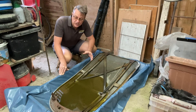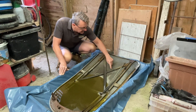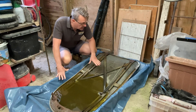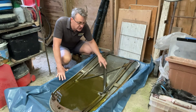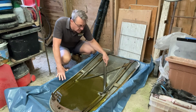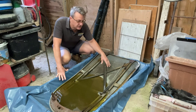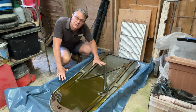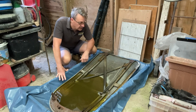So I'm going to buy a couple more bottles of the crystals, replace the plastic, fill it up, and complete the rest of the job. Importantly, the aluminium is fine - it's not affected that at all. So I haven't got any worry about it corroding or damaging the aluminium, which was the whole objective - to get rid of the rust on the steel but have no impact on the aluminium. It's not even been 24 hours yet; it's only been in since about six o'clock last night and I'm now about 12 o'clock the next day. That short period and it is actually working, so I'm confident that once I fill it up again this is going to work.